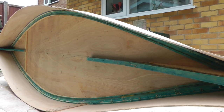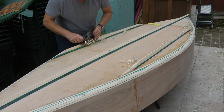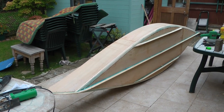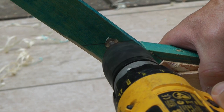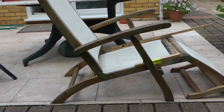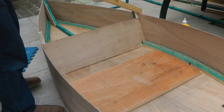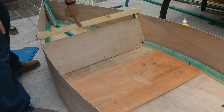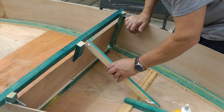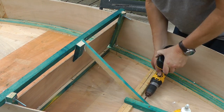Here's a look at the inside of the boat when it's up on edge, with a final bit of planing and sanding. I drilled a hole in the front — that's where the rope's going to fit. I looked at my chair on the patio to work out what angle the backrest should be, then made a little bit of wood either side, a bit of ply in the middle, and a piece along the top to make it nice and strong. Then a little triangulating piece at the back strengthens it and adds a lot to the rigidity of the whole boat without adding any weight.